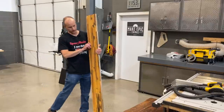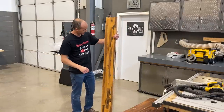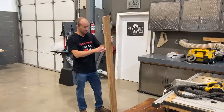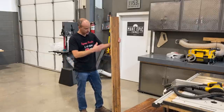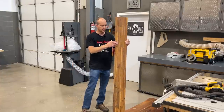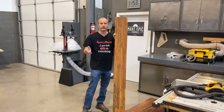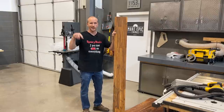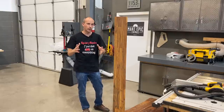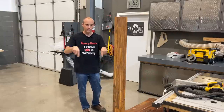So I've kind of scrounged through our wood pile and found this offcut of acacia. This is an acacia tabletop or something. I think it actually originally came from Home Depot. So it's finger jointed acacia. So what I'm gonna do is cut it down the middle. We're gonna plane both sides to get the stain off. And then we'll cut four pieces at 45 degree ends, effectively creating like a window border or like trimming out a door, right? Four pieces with 45 degree angles on each corner, glue them together, and that'll be our square base.